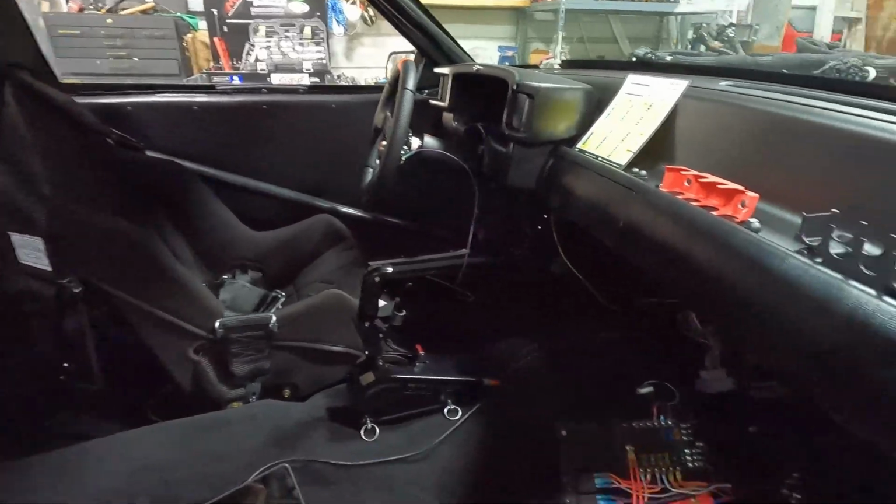Okay, so all I'm running is two signal wires to the back to turn those relays on. So I kept the high current wires to the fuel pumps really short. That keeps the heat down, and it's better. So yeah, that's pretty much a quick little rundown update.